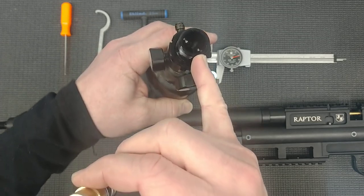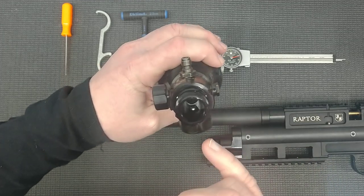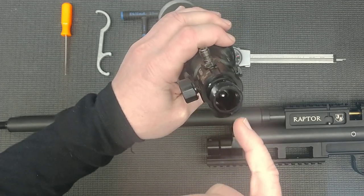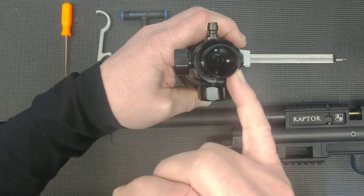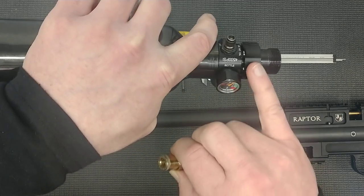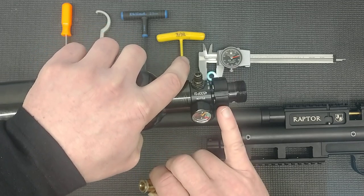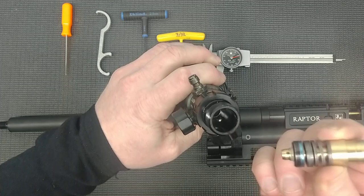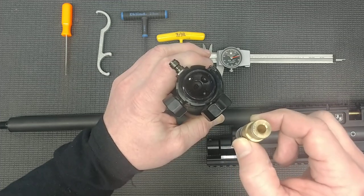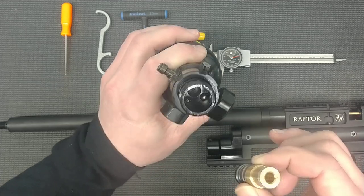You'll see big scratches on that bore. While we have it open, it would be a good time to clean this out thoroughly with compressed air, because there are stainless ball bearings in there that are open to atmosphere. If you're getting dirt in there, that alone can work against you — the carriage has to wiggle in and out each time it comes back down to seal, so just cleaning it out can really help.